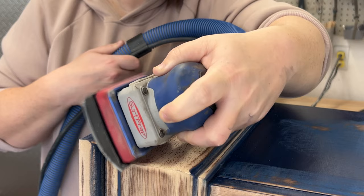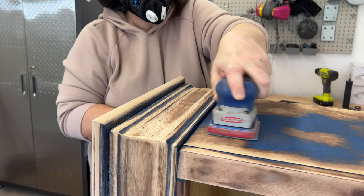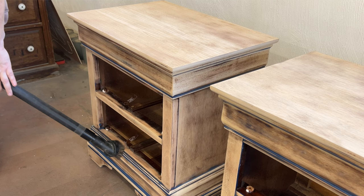I'm going to be doing a faux wood finish on these, which may seem a little silly at this point with all of the real wood now in front of me, but I promise that it's the best choice in this case. The mahogany veneer that's over the large flat panels of particle board on the sides and MDF on the top is super thin.